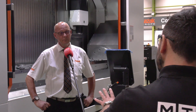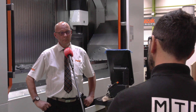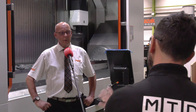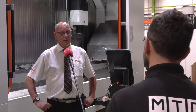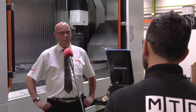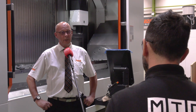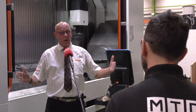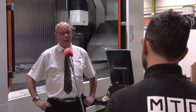You've got some similar VTC models that you also manufacture here in Worcester — can you tell our audience what they are and the differences? Yes, we have the basic five-axis VTC 800 SR, which is a single rotary — so only five axis. Then you have the VTC 800 SLR, which is a single large rotary — a one-meter diameter rotary horizontal table built into the left-hand side of the machining area.